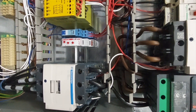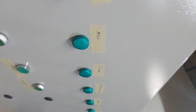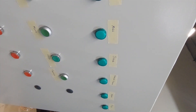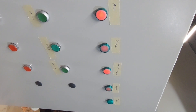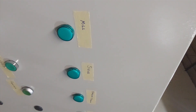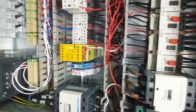Still not on full speed yet. This is like the RPM switch. Now if I take it up to 50 hertz — full speed now — it starts the rest: it starts these three motors, one, two, three. So when the speed goes down again they go off. When I put it up to 50 hertz it pulls in the other contactors.